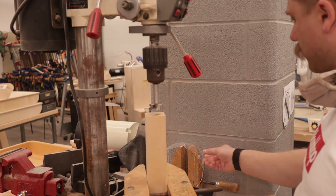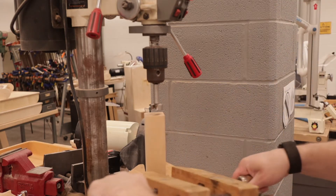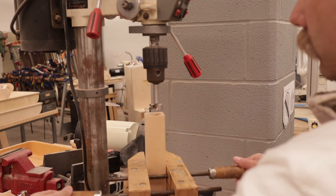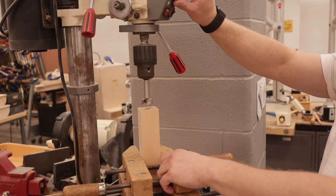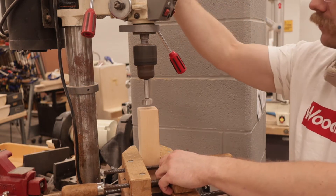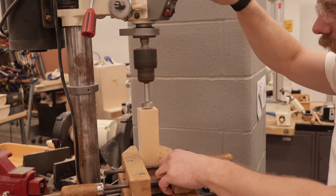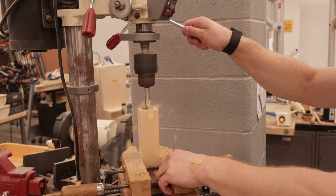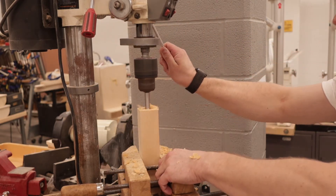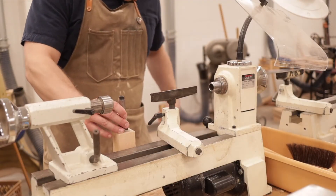This also is going to tell us where to drill the hole. The ball is an inch, and the Forstner bit that's going to make the hole is 1 and 1/8 inch. When using the drill press, make sure you go at a speed where you get wood shavings coming out, not just dust and smoke — that means going too slow. You can see there are a lot of curls coming out; that's good. Going in about an inch, an inch and a half into the wood.